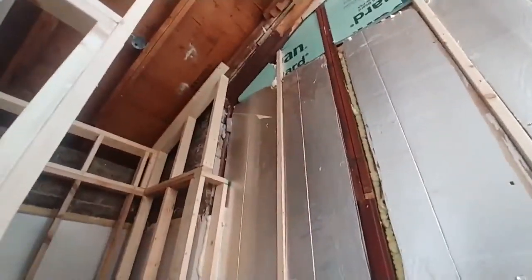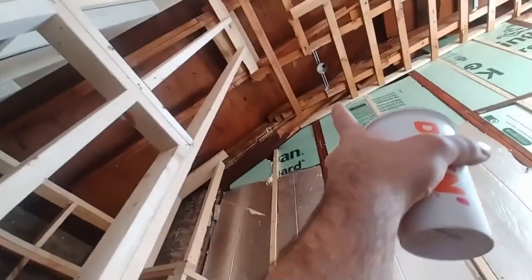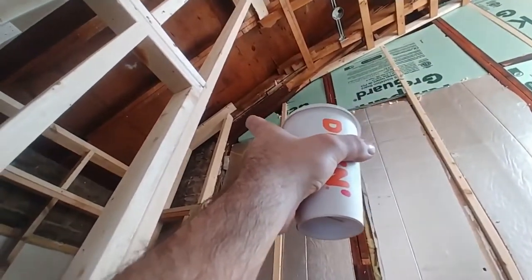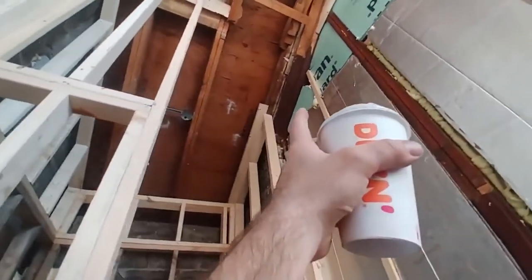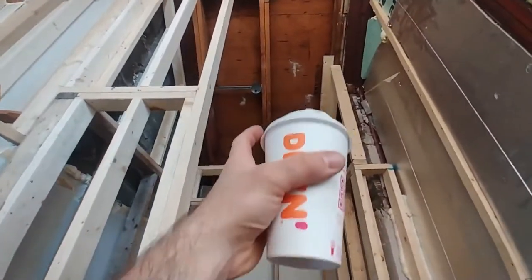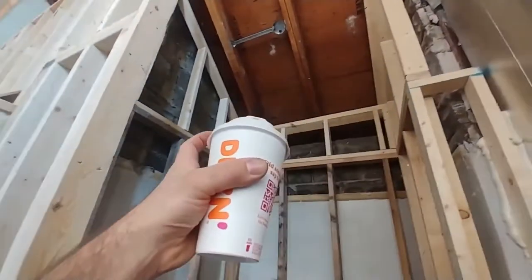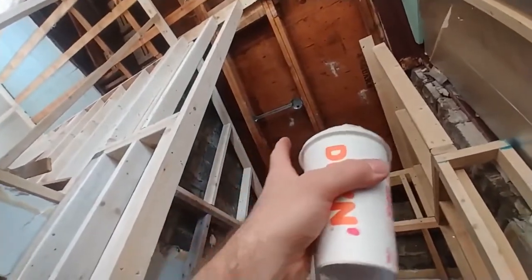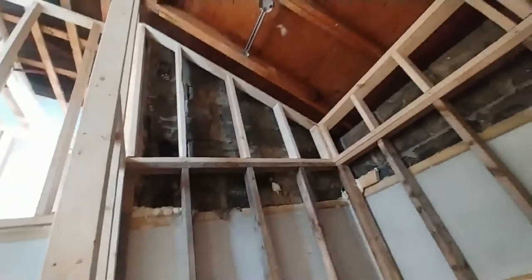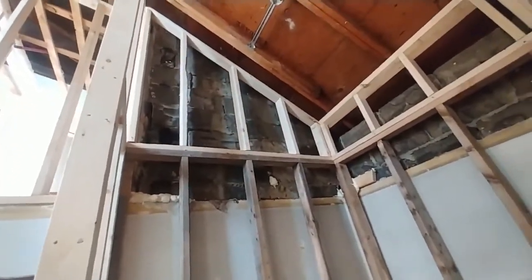However, the plane of those furring strips does not eclipse the plane of all this drywall here, and it doesn't get over this red framing. So I'm thinking if I were to come down to that surface and pull that surface across the top of this room, I could force this inside corner to be level, and we could add thickness to the ceiling area in this room, which would allow you to put more insulation in, because it's currently 2x6. So it's kind of a squish to get baffle and then the R23 in there.